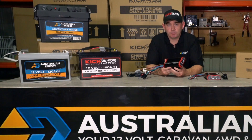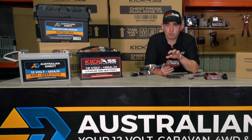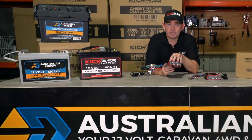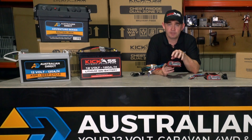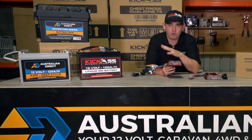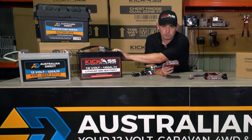At Kick-Ass we've been really smart about how we handle alternator versus solar charging. The priority charging source will always be the alternator over solar, because your alternator can always put out far greater current and charging force than your solar panel. So if your solar panel drops to a lower charging level, your alternator is always the first priority, making sure your batteries are fully charged all the time.